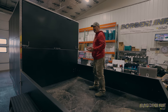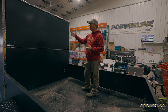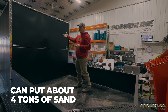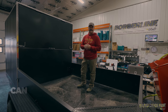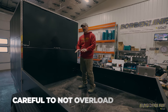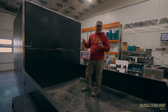A trailer like this with 7,000-pound axles and a 14,000-pound gross — with all your materials and equipment — you can put about four tons of sand. We get weighed here, so it goes by tons, or four yards, with your Portland and your equipment, and you're going to be right at that 14,000-pound range. You've got to be careful you don't overload. If you want to haul more sand and need to do a lot of curb, we'll load up the sand but take the Portland on a separate truck so the trailer doesn't weigh as much and you avoid those problems.